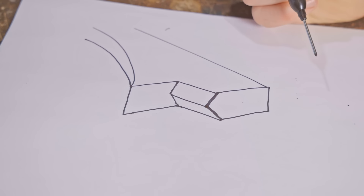The last thing to do to the cutter is to put a bevel on the inside edge. You can see it better in this sketch — the reason is the point of the bevel will get right into the corners of the template.